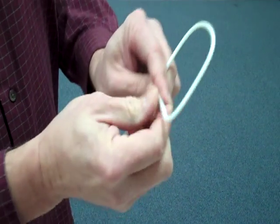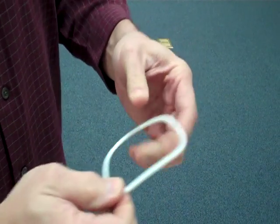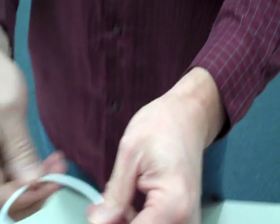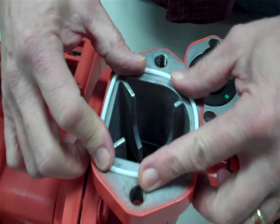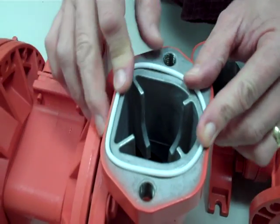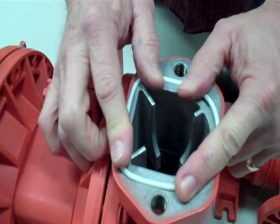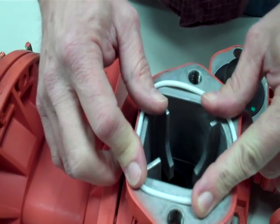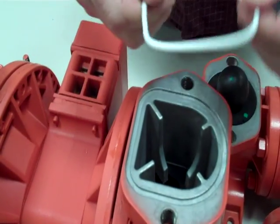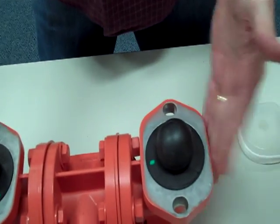Once it's in more of a D shape than it is coming off of the form, you can't simply place it into the O-ring groove at this point. It just simply won't stay. No matter how you push and form, it's not going to stay inside that groove. It would be impossible to hold it in place unless you literally glued it, and that is not necessary. What we want to do is place it actually on the inlet manifold assembly.